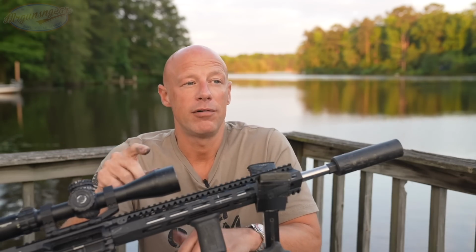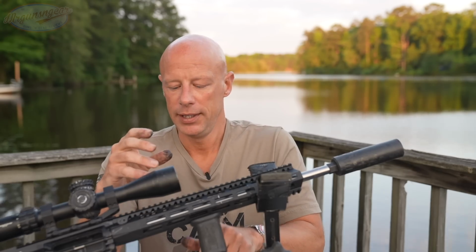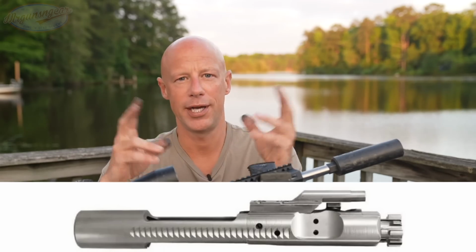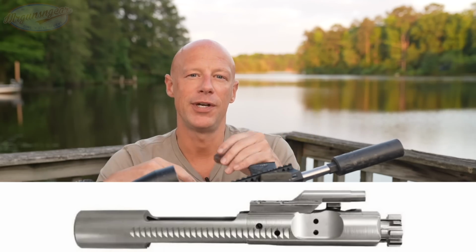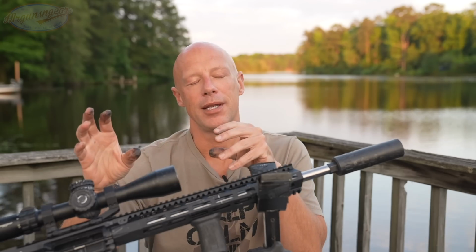The one I would say be careful about, and in no way am I saying it's bad, is the nickel boron finishes. So nickel boron can be very good. It's a very shiny finish, and just like the nitride one that we talked about, it has good lubricity. And a lot of folks will say, oh, the oil or the carbon, which you see all over my hands here, wipes right off if you have a nickel boron finish, which it does. That's true. It's easier to clean them. That said, all of these are pretty easy to clean, and I wouldn't make a decision based on that personally. And the nickel boron, if done correctly, is a great finish.